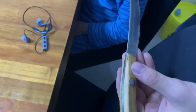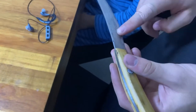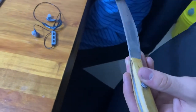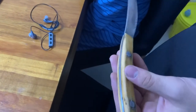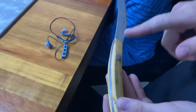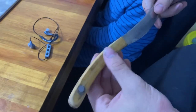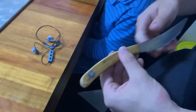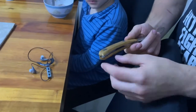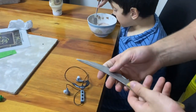What I did is I used the shape and the blade just comes naturally from hammering in the bevel, because the material moves up and bends up the blade. For the handle, I thought it'd match the look of the blade — the bend — so I bent it around the other way and put it on the horn of the anvil and hammered it down lightly. It was too long to fit in my quenching bucket so I just cut down the end of it, and I think it fits pretty well in the hand.